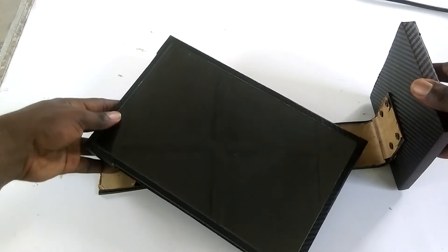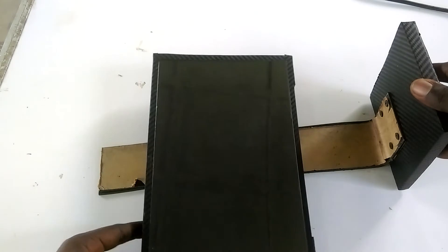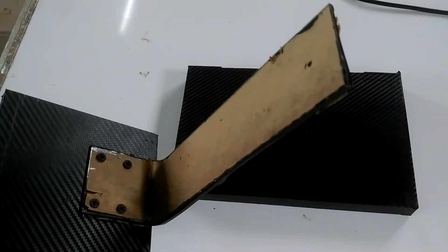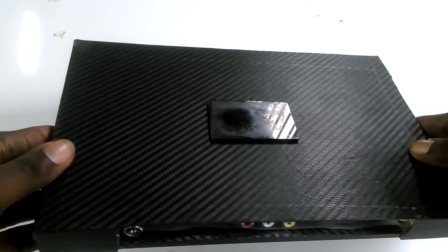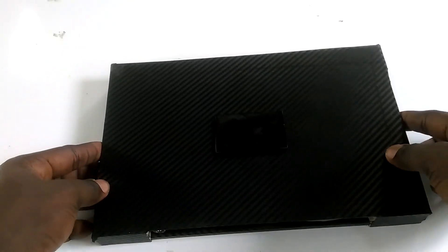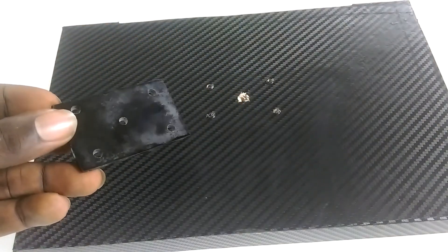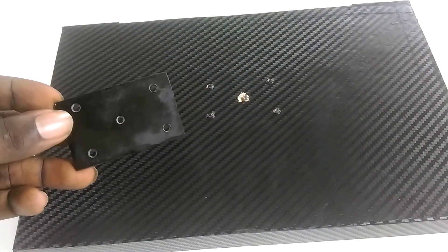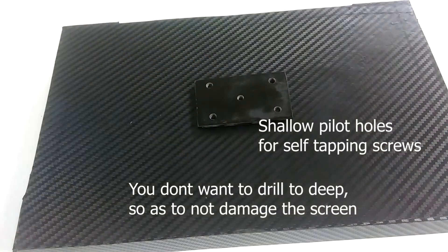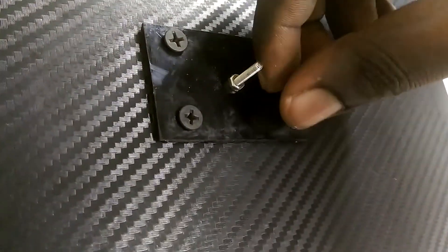I did a test fit to see how far I wanted the screen to be from the base — it had to be far enough to allow the screen to rotate freely without hitting the base. I then cut off the extra length and drilled a hole through the top. Next, I cut a small piece of acrylic, drilled five holes through it, and attached it to the back of the screen where the stand would screw on. I also drilled four pilot holes at the back of the screen for self-tapping screws, plus a larger center hole for a bolt. Two nuts were used to prevent the bolt from wobbling — one in the back and one in the front.